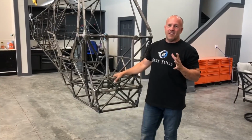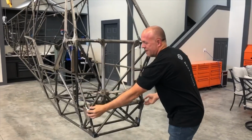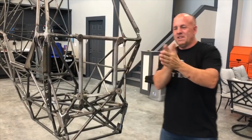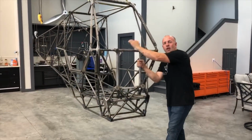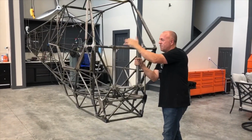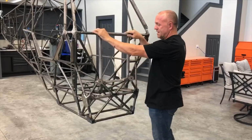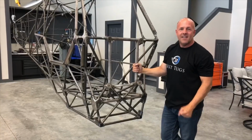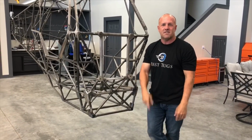All right, so on the front of this plane, this was one of the most challenging parts. This motor mount, normally you would see bolt points here and here that carried a motor mount out away from a firewall, and then the motor hooked onto it. This used to be original airframe to here and then a motor mount. We backed all the way back to here. This is permanently part of the airframe. It doesn't unbolt. So that helped me save some weight, some bolts, and gave me a much stronger airframe. So this is the motor mount, complete, and no bars. I'm really excited about that. There's still a bit more work to do, but we're going to bolt an engine on the front of this and see how it fits and see how my feet pass through. Everything should work out real good, so let's put on an engine.